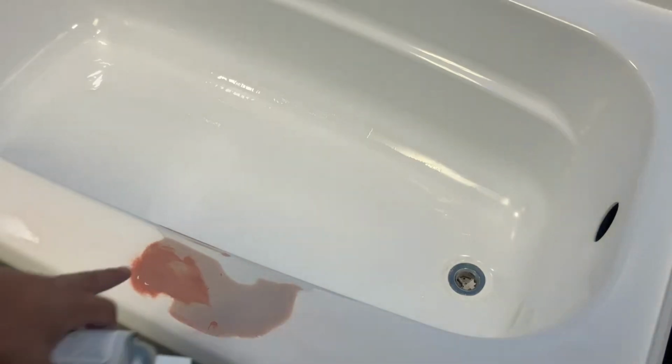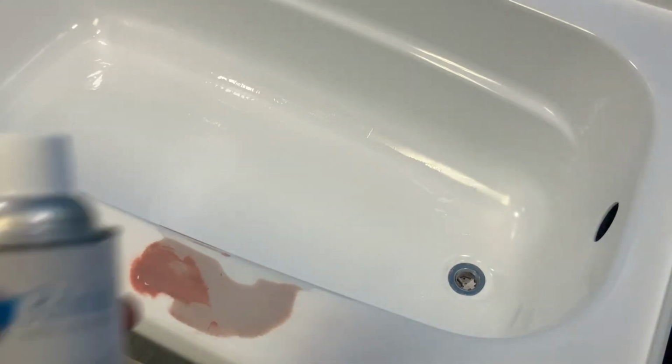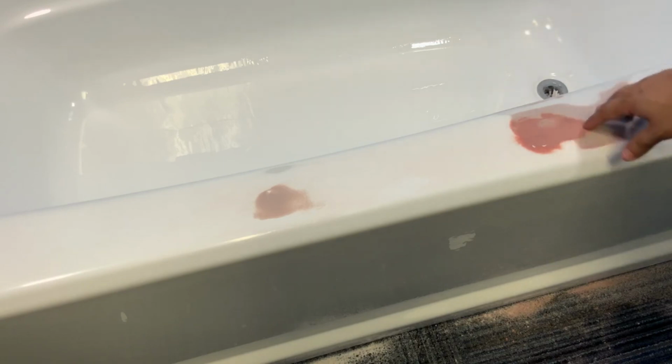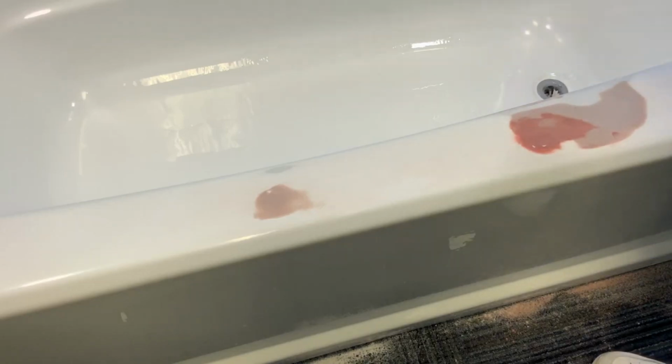Now let's touch up these areas with the spray touch-up kit. So, simple shaker can. This is solvent based, but for top pieces like this, it's the best way to fix them. You can use those Ekopel touch-up kits, but sometimes you get drips down the wall because it's made to run down to the level surface. So I use the spray touch-up kit if I'm going to do it, and here I go.